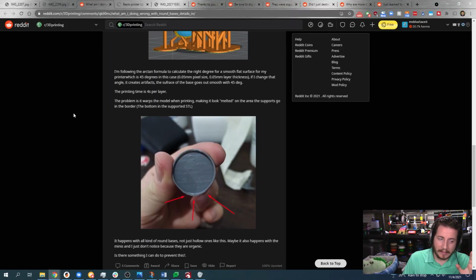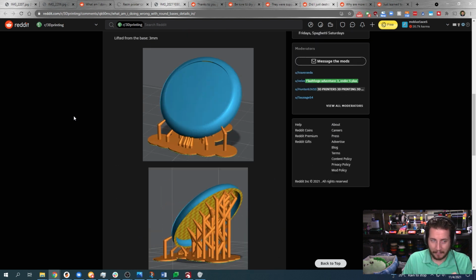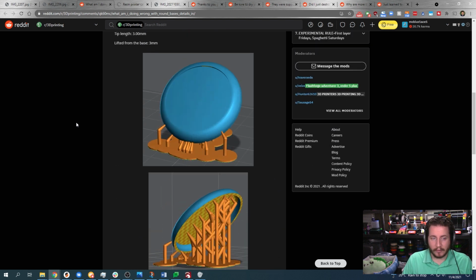But let's assume you did that. I'm seeing that you don't have enough support material. And you might say, well, Grant, Lychee Slicer says I do. Well, Lychee Slicer's wrong. Lychee Slicer has the ability to set your supports from minimal to ultra. I think ultra is only available to paid subscribers, and the high is the one that is available to free users. But I don't believe that normal is enough. I firmly don't believe it's enough.